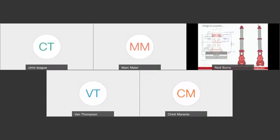In this particular case, I've got leg two drawn 1 inch out of level at the base. If you take that all the way to the top, that 1 inch out of levelness at the base translates to over 6 inches of drift at the top. And so trying to lift the load with this magnitude of deflection can cause uncontrolled movement of your load and really damage the internal cylinder.